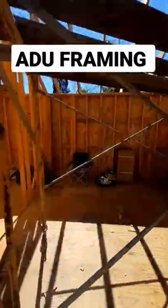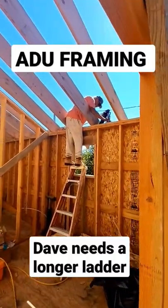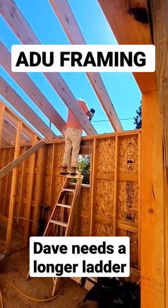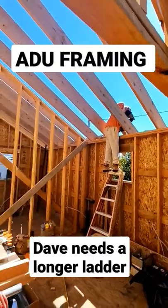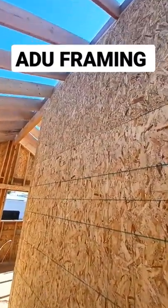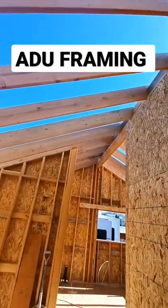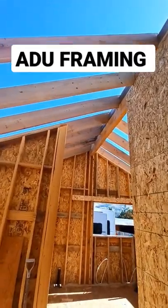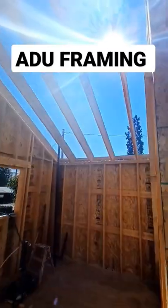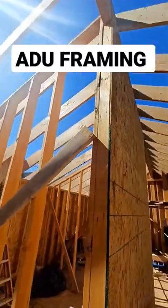This will be Dave's sleeping area. Dave's over here — looks like he's on a ladder right now doing the vented blocks for the vaulted ceiling. One principle of a vaulted ceiling is you have to either do a warm roof, where you blow in insulation or use rigid, or a cool roof where you have a 2-inch ventilation that comes in through each individual bay through those vented bird blocks and up and out the vault.